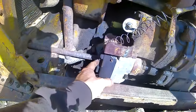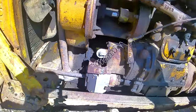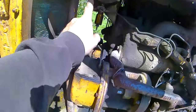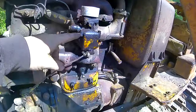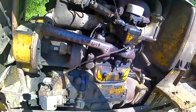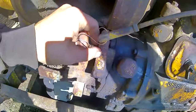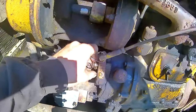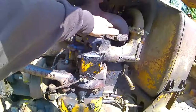It's not called a magneto. What the hell is it called again? But anyways, the best way to actually do it is turn the fuel off up here on this valve. Then it just runs the carb right out of fuel. There's no old gas left in it. It just stalls out on its own. You flip it back up to idle first. You disengage this governor, put it on idle, and you just let it idle out until it runs out of fuel. That's the proper way to do it. Sometimes I'll just choke it, though. I'll put my hand over it because I'm in a hurry.